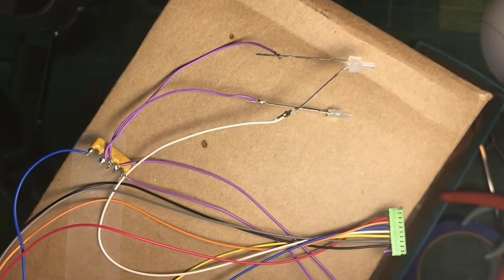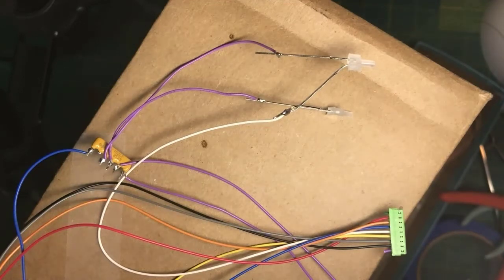Okay, as it happens, I only do very small locomotives and critters, and I only do a headlight and a backlight. So I have been using one resistor, so I'm probably safe with that. You're getting away with it, but in terms of reliability, best practice is one resistor per light emitting diode. But if you don't have the space and you're getting away with it, I tip my hat to you.